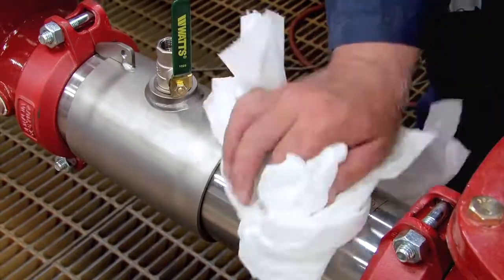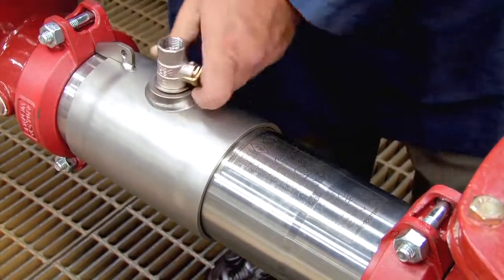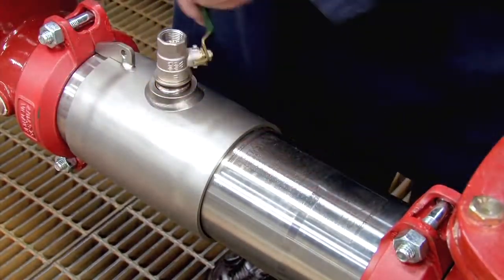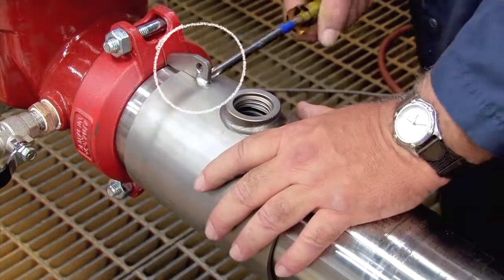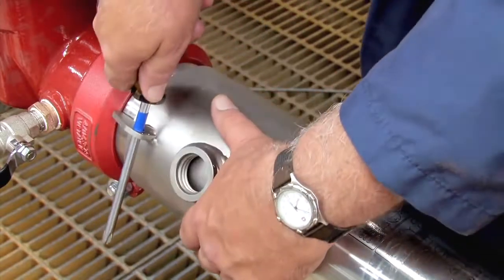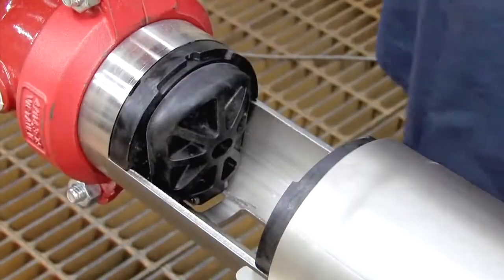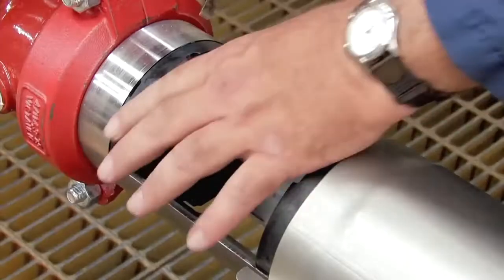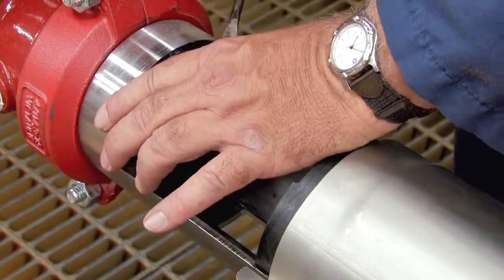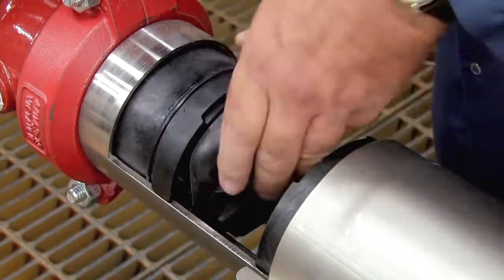Before opening the unit, clean off any dirt or debris that may have collected on the valve body during its life. Once clean, unthread the number 3 test cock. Insert a number 3 Phillips head screwdriver through the hole on top of the valve sleeve and, using the screwdriver as a handle, carefully rotate the sleeve left to right to break the O-ring seal. Gently pull the cover back, remove the stainless steel check retainer plate. Locate the two slots found atop each check and carefully insert a flat blade screwdriver between the check and the valve body. Gently slide the module towards the open zone, pull the check free, and remove it from the assembly.